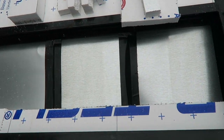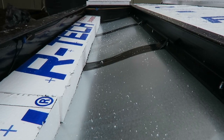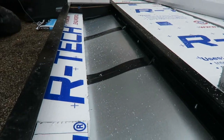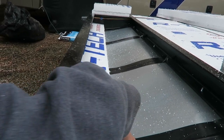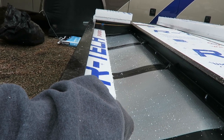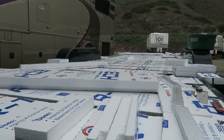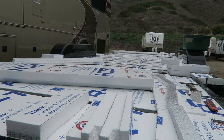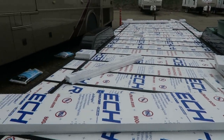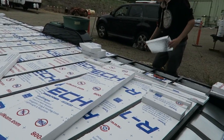What we decided to do — Michael came up with this — these are just scraps from the 2-inch boards. We put them in here so it's going to make it flat on top since the flashing was angled. We needed something to make the 2-inch and 1-inch boards sit correctly on top. So we put these on the ends and then everything will be flat. These side pieces are actually super annoying because they're all different sizes.